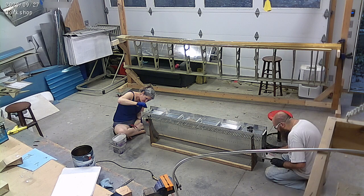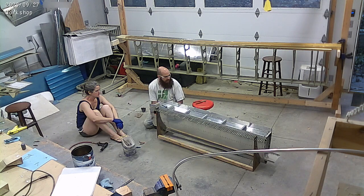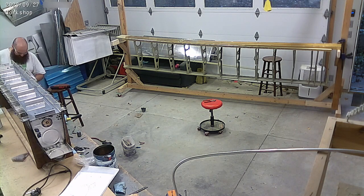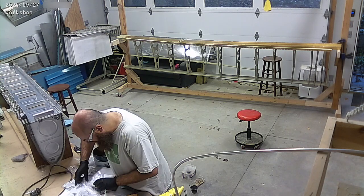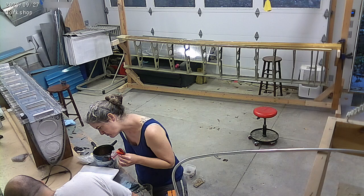This step is the easy one. It's just like plopping the ProSeal on, putting the baffle on the back, letting it sort of skim the ProSeal into place, and then those Z brackets on the top are pulled rivets. So that's not too hard. Getting those aligned is a little finicky, but no big deal.